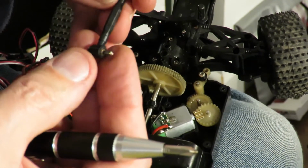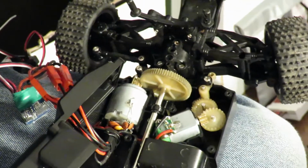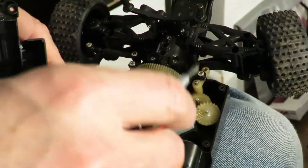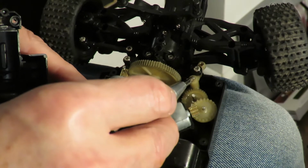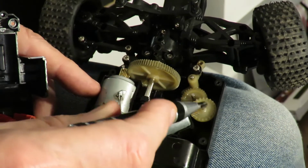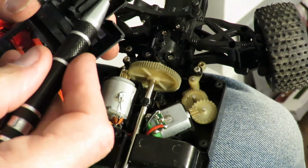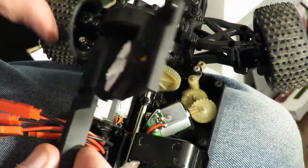It's really stiff. I'll just put that in upside down, but it doesn't matter. So that's the linkage for the right hand side. If I push all this back together carefully, and I've got to do it carefully because there's holes here that the pillars, let's say axles, shafts, that's the word I'm looking for. The shafts at the middle of these gears, on there and on there, on the pivots, they all link into these bits. So you've got to get it all in the right place, otherwise they don't pivot.